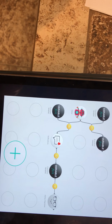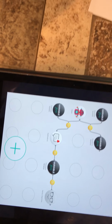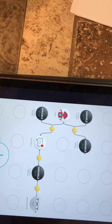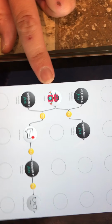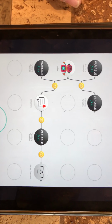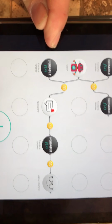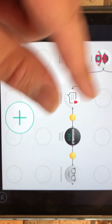Right in their IDE, it says you can create a webhook. I said create a webhook that, when the event mailbox is triggered with the contents of on, just like we sent in our code, sends a web request. I had it send a web request to one of the Stringify Maker web requests. You could do it to whatever service you wanted. So this bottom route basically says, if the web request fires and the variable is 0, so basically the first time of the day, then send me a notification and reset the variable.